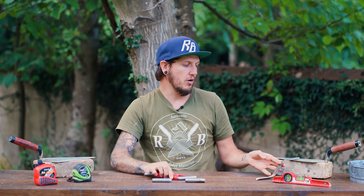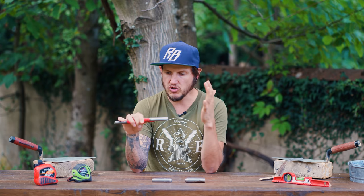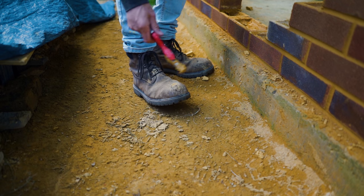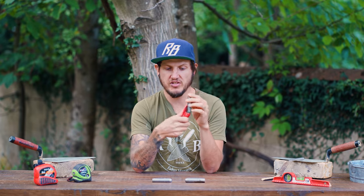I'm very impressed with how smooth you can get your joints with it — perhaps because it's brand new and my old one has slight rust stains and isn't quite as smooth. Now onto a slight negative: it can be quite messy. When you're jointing up, mortar gets collected in the little crevice where the barrel meets the handle. It builds up and there's a chance it could drop down the side of your brickwork and stain it. I prevent this by hitting the jointer on my steel toe cap to clean it off — I do it every two or three perps or beds.